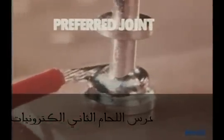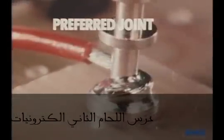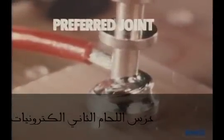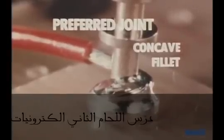How do we know this is the right amount? What do we look for when judging a solder joint? First we remove all the flux so that we can examine the joint. This is the way a good solder joint looks: it's bright and shiny, and the solder has feathered out smoothly, showing good wetting action along all the elements of the joint. The area on the side is known as a fillet, and on a good solder joint, the fillet is always slightly concave.